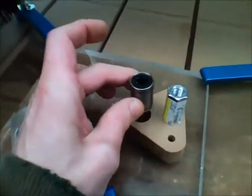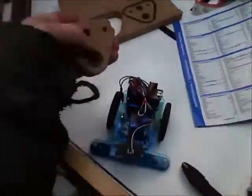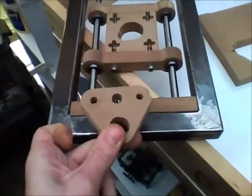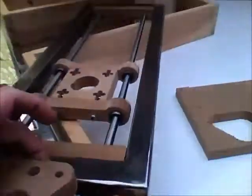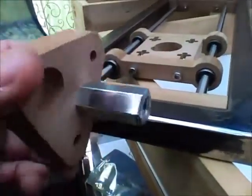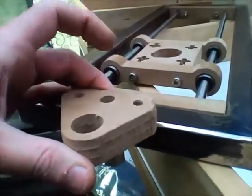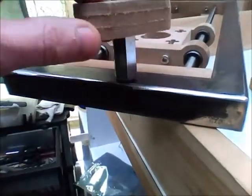The linear bearing will press in there. I'm going to drill a hole here the size of the coupler nut so it'll slide through. It'll sit on the edge of my X-axis — one at the bottom with the coupler nut going through the metal, captured on each side by this plate. These two holes are through bolts, so we'll have a bearing at the top and a bearing at the bottom, the coupler nut goes through, and the whole thing is clamped together by those two holes. And that is what it looks like in Lexan.